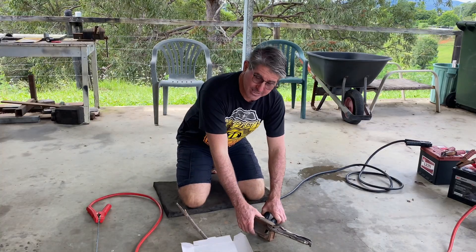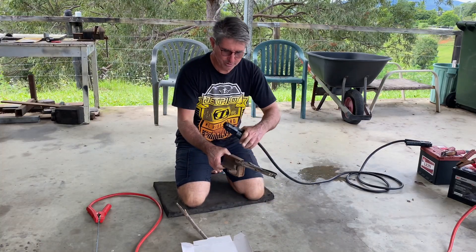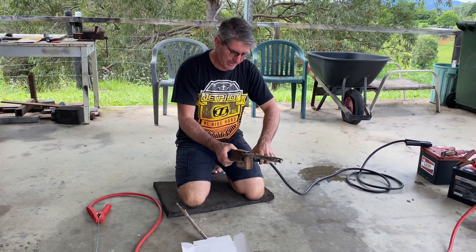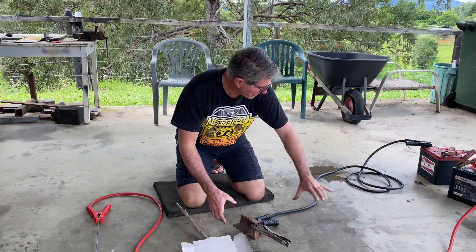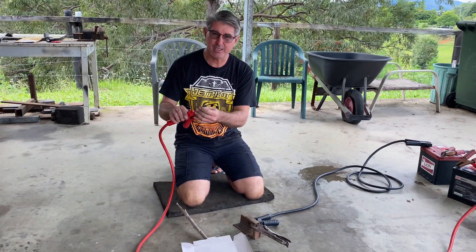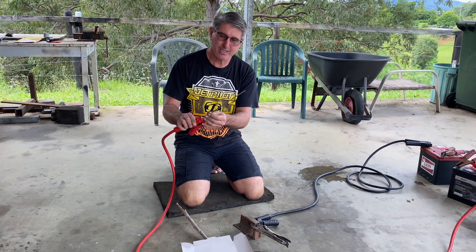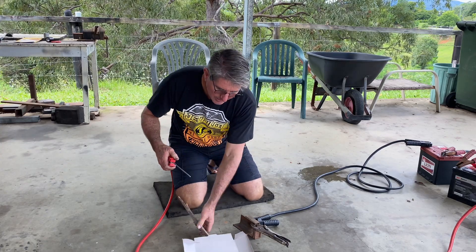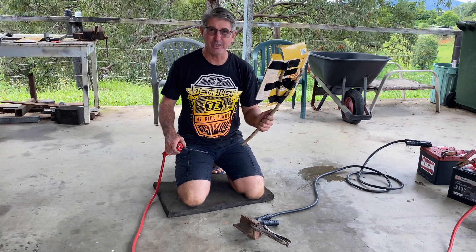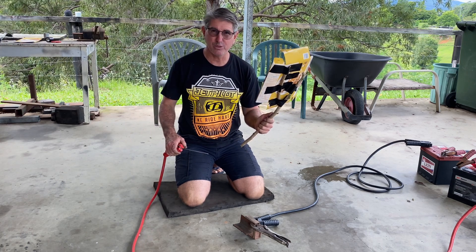Okay, so I've got a couple bits of steel here. I'll just burn a little weld along there — connect the negative lead. Just be a little bit away from the batteries as you're doing this. Put a rod into the positive lead, and we've got our makeshift helmet which I prepared earlier. Now we are ready to weld.